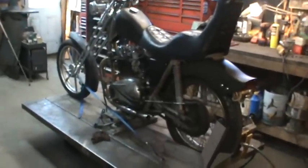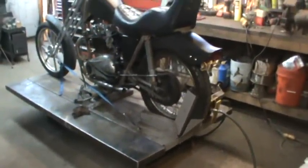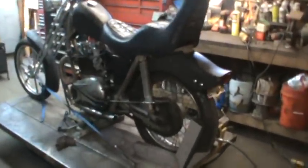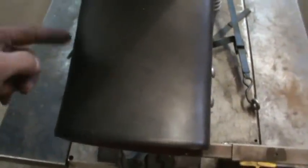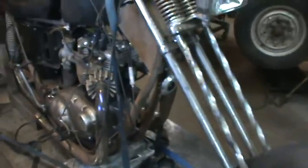We're winding this video down — I just kind of finished up what I needed to do. The fender's all set, the bolts are loose, the tail light is just kind of sitting in there and you can see the difference on the angle. If he wants to cut the fender back, or what he can probably do is take the brackets on the tail light, bend one this way and one this way, let the light shift a hair — there's some play in the bolts. Then just drill the hole for the horn to be mounted.